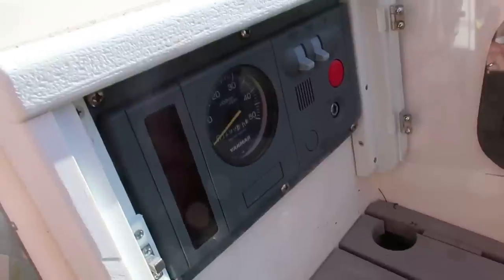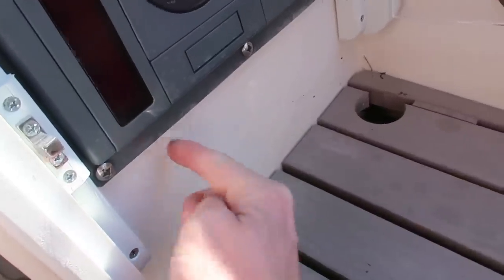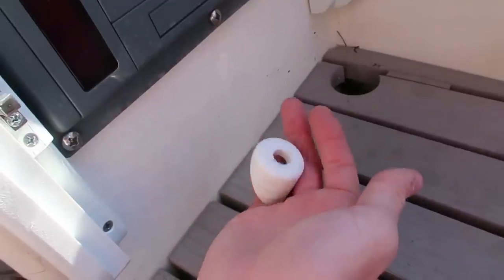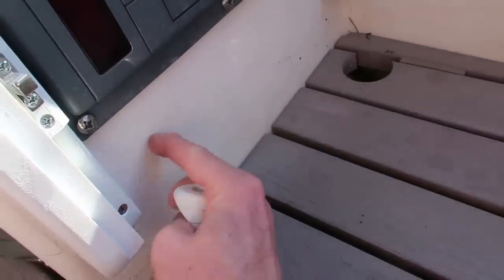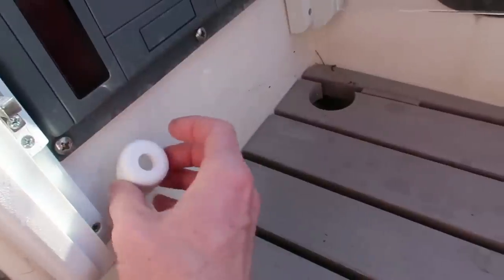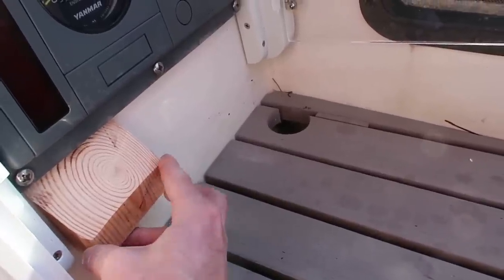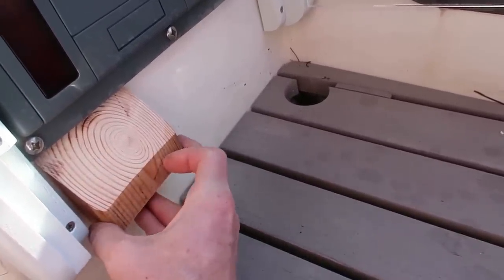Here's the engine control panel. We're going to be mounting that kill cable probably right in here. But again, it's not going to go straight in perpendicular to this surface — it's actually going to be turned 45 degrees so that it has plenty of room to clear that AC panel. The way we're going to do that is I made this little fiberglass boss that's cut at a 45-degree angle. We need to drill a hole here and then mount this little guy right there. The tricky part is I have to drill the hole at this 45-degree angle, so I cut this hunk of 2x4 and I'm going to get it in position wherever it's going to go. Then I can drill perpendicular to the top of this 2x4 rather than trying to fight with drilling it at a weird angle.